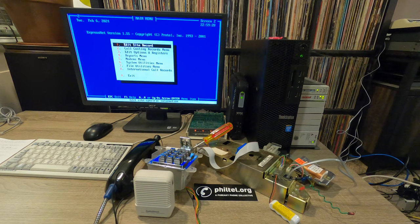So as I mentioned, this is running Debian 11. I believe that's the long-term support version of Debian right now. I tried to do Debian 12, but when I installed Asterisk on this machine, so I'm running Asterisk version 21, I'm using it with Dahdi, D-A-H-D-I. Dahdi is what you are using essentially to interface with T-Carrier hardware from Asterisk.